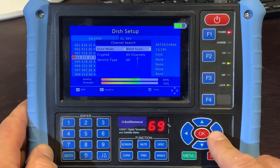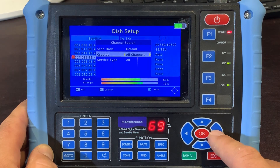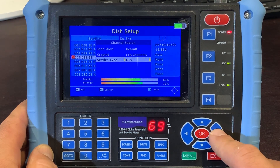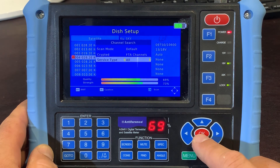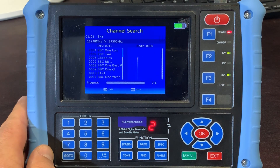It's going to ask what I want to scan — a blind scan or a default scan. We'll just leave it on default. I'm going to select free-to-air channels only for the purposes of this. Once you're happy, you can also select specific channels, but we're just going to click All and then click OK. It'll ask if you want to run it, because it will delete anything else already saved in the meter — click Yes, and now it's going to carry out a scan of the band.